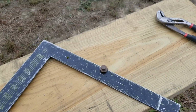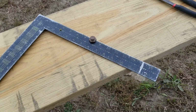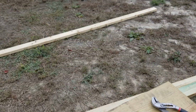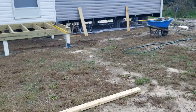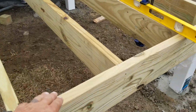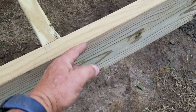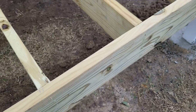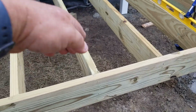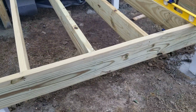And the only place where you have to do a little bit of calculation, not calculation, but you have to account for, is the thickness of the plate, of this plate here. Some people will put it right up against it. I like mine going underneath and actually fastening to a joist. It's much better that way. Or at least put a horizontal block across so that it pushes up against something there.